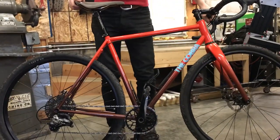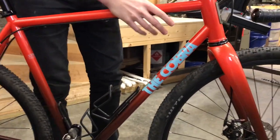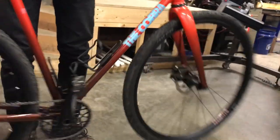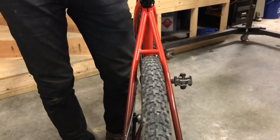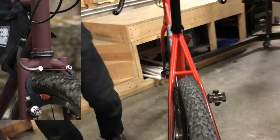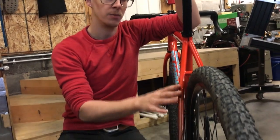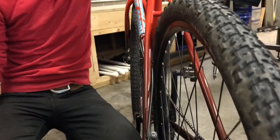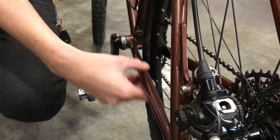One of the things that I did with this bike that I thought was really cool was the single-bend rear end. If you look here at the tubing, it's kind of angular and blocky and most of the tubes are pretty straight. On the rear end of a bike you can do S-bend stays that have a curve to them and curved bridges, and that stuff looks beautiful when it's done. There are a lot of builders who do that well, but I wanted that more straight-line, angular aesthetic. The precursor to this bike had a segmented steel fork with more of a square-shoulders, angular look. I was trying that on the previous bike and then I refined it even more on this one, and I think it just looks awesome.